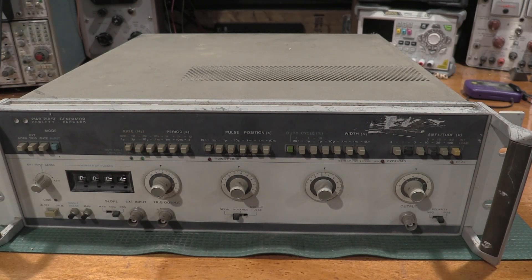This does 200 watt power pulses, and is good for pulsing things like laser diodes and a couple of other things — anything that would need a power output pulse with a reasonably fast edge rise time. It's not super fast edges; we have some super fast edge equipment in the lab, and I would not put this unit in that category. However, for power pulses, this will deliver some substantial power to the device under test.